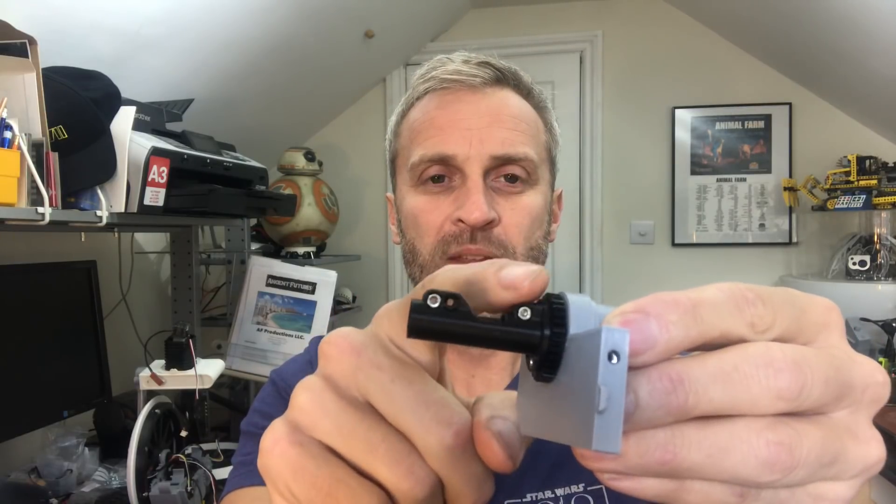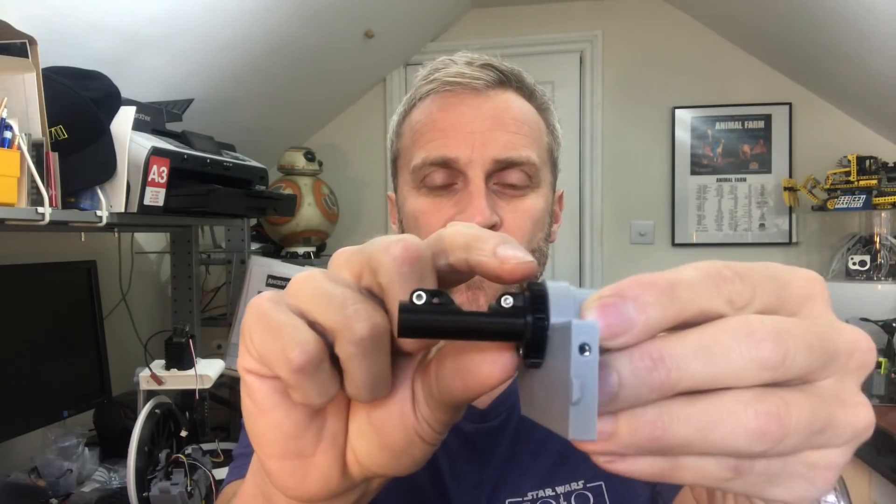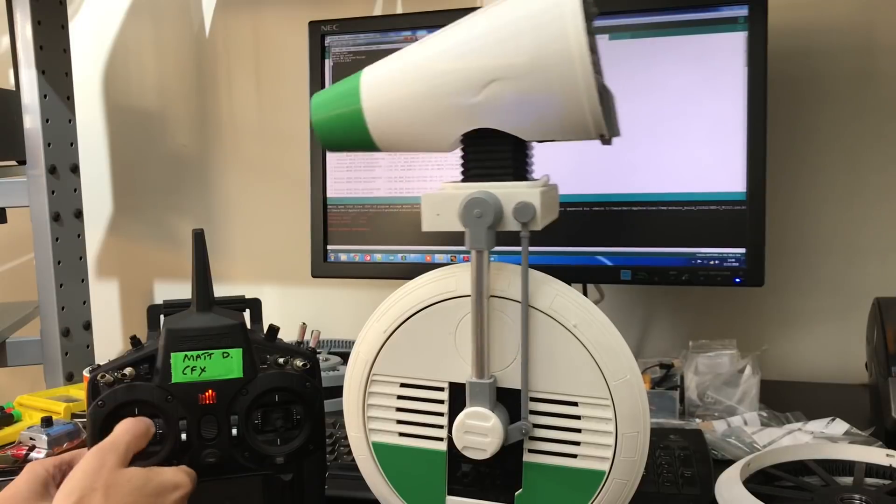I've implemented one quick change which is that shaft clamp — I've added two bolts at this end to try and tighten it up, and I've also printed this in PETG, a slightly tougher material. This end doesn't really need it because the clamp here is only to stop the shaft from sliding out — it's not actually transferring rotational torque, because that's done by the bolt down here. I'll put that in and see if it's helped. So that's basically holding place now — it's not shifting.